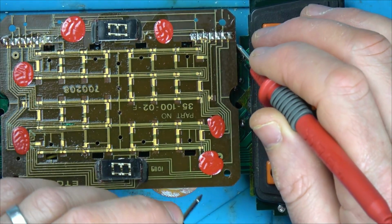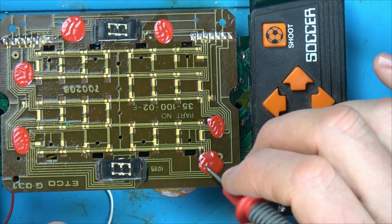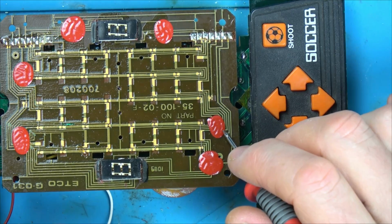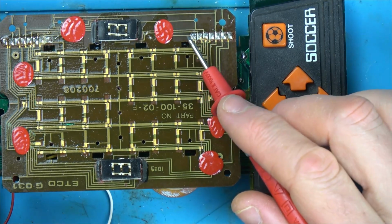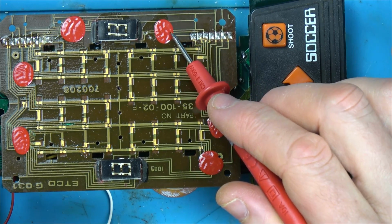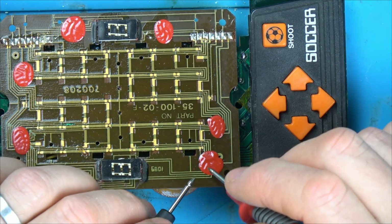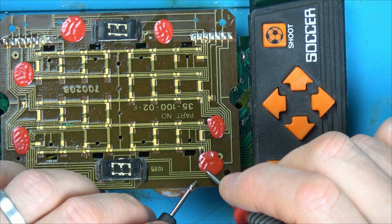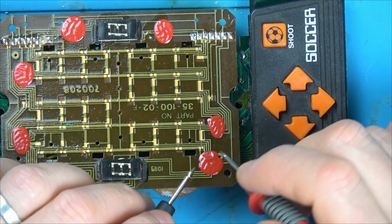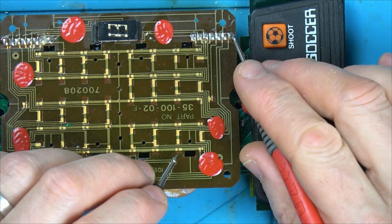Yes, it is. It does jump over them. Maybe that's why they need this stuff here to lay it. I don't know. That doesn't make sense. How is it jumping over them? Yeah, but every place where they jump, it has this stuff here. Don't quite understand how they've done that. Ah, do you know what? They must be soldered wires. There must be a pad, and they must have soldered a wire across and then put this mess on to jumper it. Anyway, let's just see if these are all in contact with here.